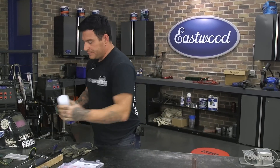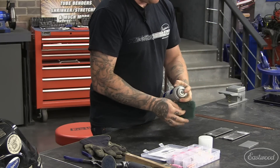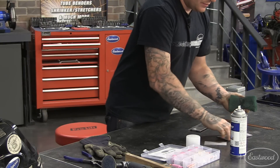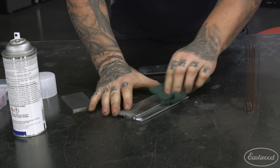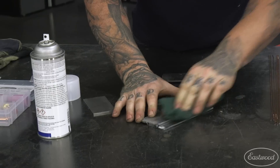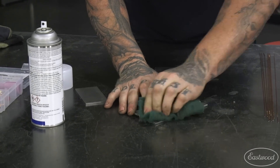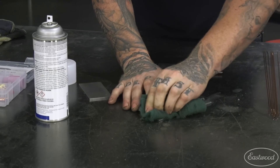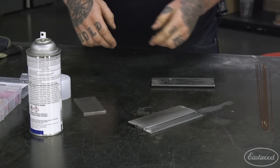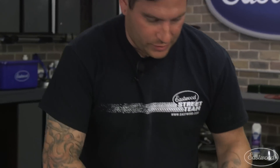So I take this pre — the low-VOC pre evaporates pretty quick. What I do is spray it on the actual scotch brite pad and go over the area where I'm going to be welding one final time. I'm getting it in there where we're going to be welding on that overlapped area. The nice thing is this stuff evaporates really quick, so in a couple of minutes while I'm talking, it's going to be fully evaporated and ready to weld. I'll do this one too while we're at it.